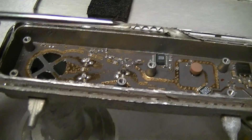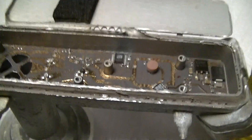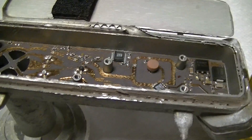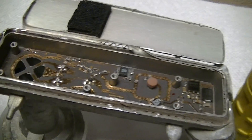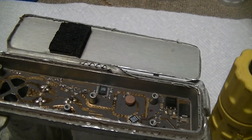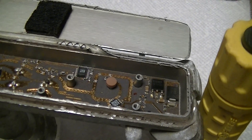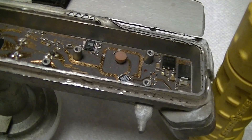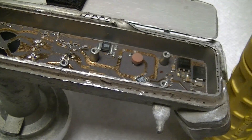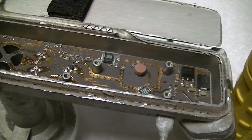10 gigacycle RF would require all kinds of black magic as far as things like feed horns — it's much easier, especially in a residential application where things are on a budget, to just do all the black magic in one thing on the roof, and then send the proportionally fairly low, conventional frequency stuff — only gigacycle range — through just television coax, where over signal runs of not more than a few tens of feet there wouldn't be any really substantial losses.